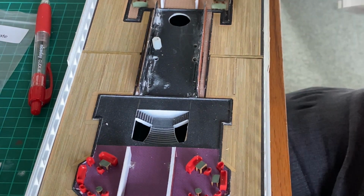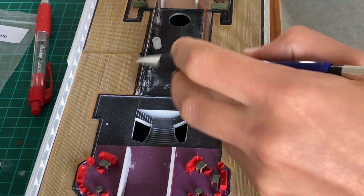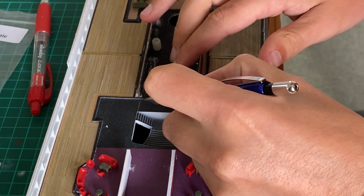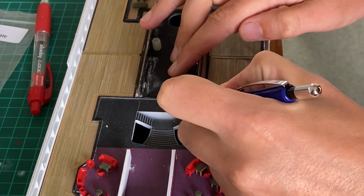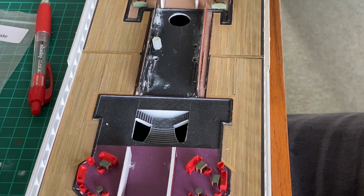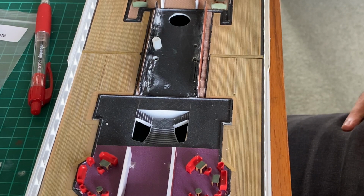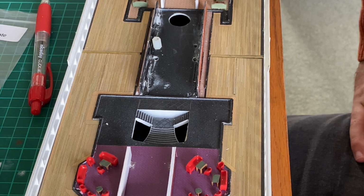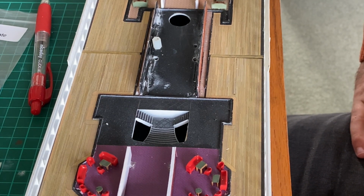Now, one of the things I tend to do when I'm cutting stuff, particularly important stuff that it really matters that you're doing it accurately, is I tend to mark out the areas that I actually want to remove. So I'll tend to just hatch them to make sure that it's pretty obvious. It's one of those things that, in an ideal world, you probably wouldn't need to do, but I would be mildly embarrassed if you knew how many times I had been in a situation like this and then I've cut the wrong thing out, or I've started and I've realized halfway through I've made a mistake and I've had to do a big workaround to cover up the error that I've done.